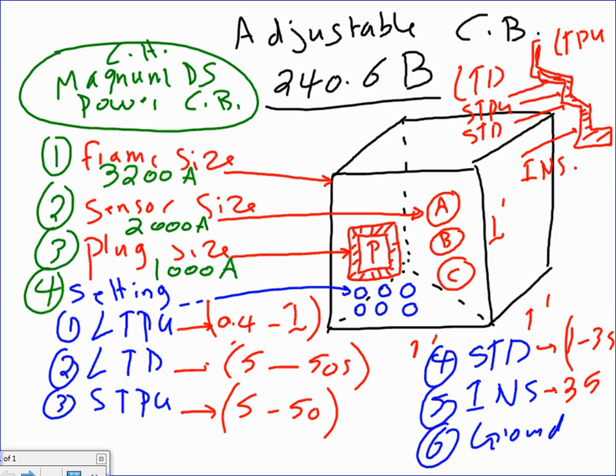You are looking at 240.6(B). That's what an adjustable circuit breaker is. We have never touched on that. If you guys remember, we always go to 240 and we just say 240. We don't say 240.A, though most of the time we're in 240.A. And if you're looking at it in the code book, 240.A says non-adjustable, so it doesn't apply to this. B is the one that applies to adjustable circuit breakers.